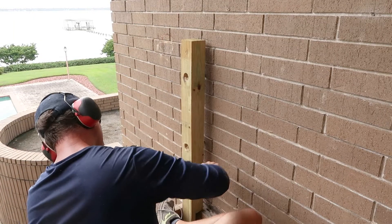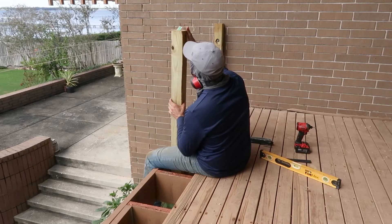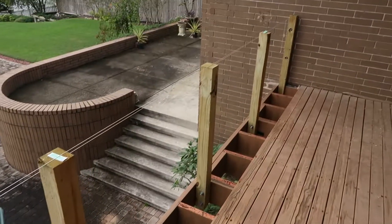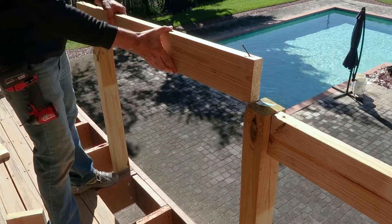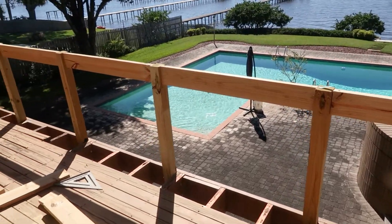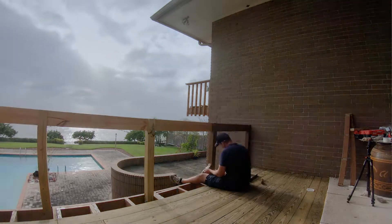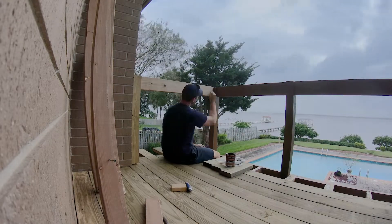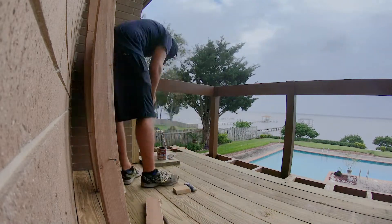Next was the actual construction of both the deck and the railing. Based on my design, I built the deck with the railing in mind, which required placing posts exactly where they needed to go. Once the posts were in place, I did the cap railing before putting the cables in, because the top rail locks everything together so the posts won't bend when you tension the cables. I also applied a coat of deck stain to the posts beforehand, knowing it would be harder to paint them once the cables were on.